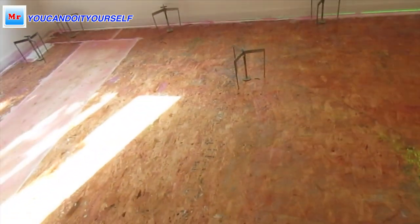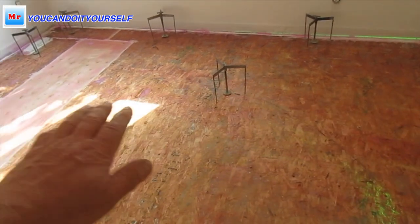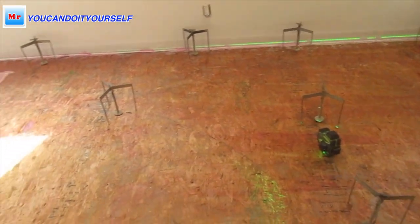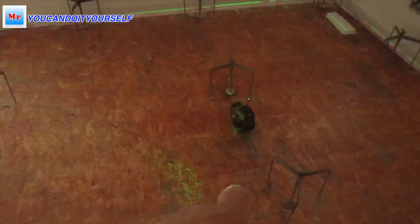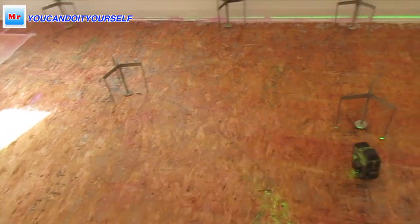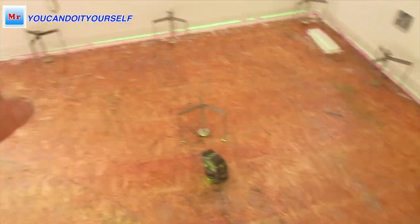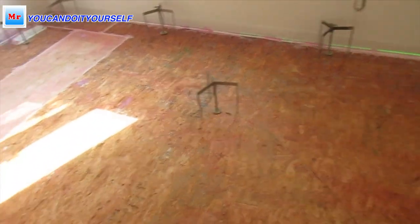When it's dry tomorrow I will slightly grind on top. If I do skim coat it's going to be flat everywhere — if I stop at this edge there's going to be a wave and then it goes up. So I need to do the whole floor with skim coat on top, and then level all of it with the tripod system.